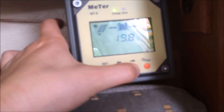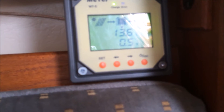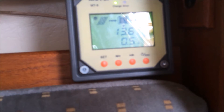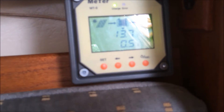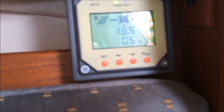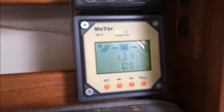I have a 100 watt panel. If you just have a 10 watt panel, those don't put out 20 volts, so something like this isn't as necessary. MPPT controllers are more helpful the bigger your array is, because the extra waste they can recover is larger. If your array is smaller, there's a lot less waste and therefore a lot less use for them.